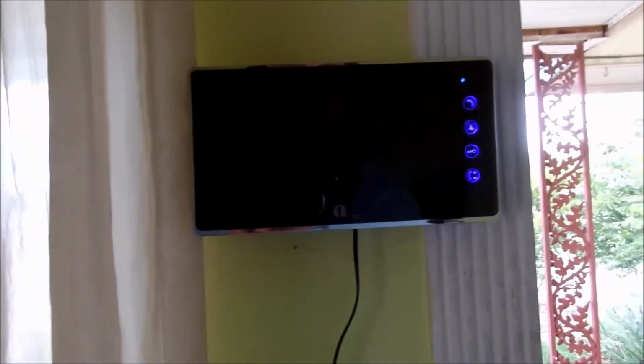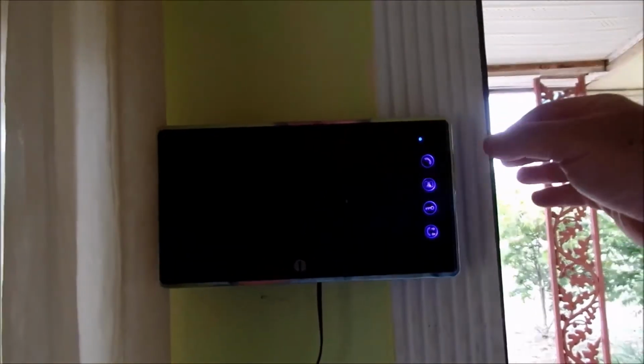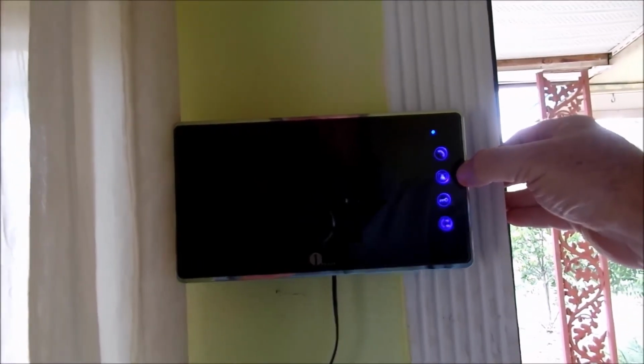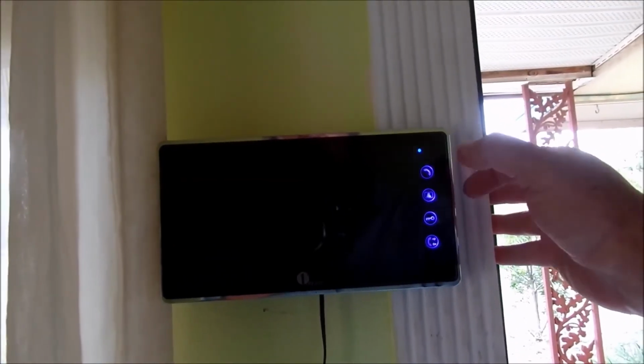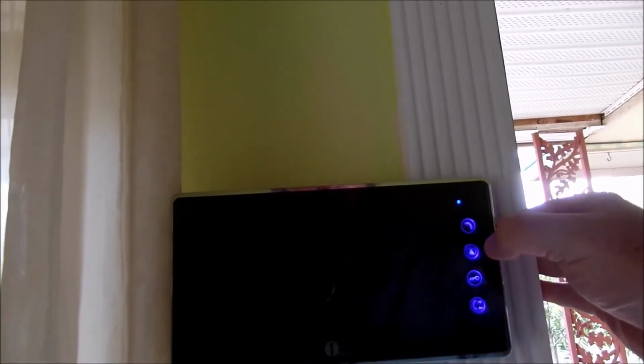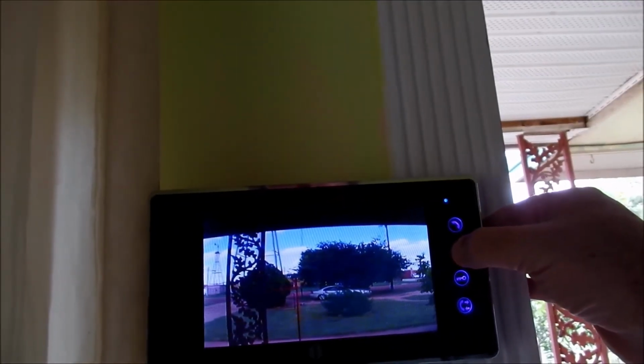And that was the one that my mother liked, so that's what we've set it up for. That changes the melody. So you're holding this button down for 4 seconds, then pressing this one, and then pressing that button until you find the melody that you like, and then finally pressing this button to lock it into place. Now let's say you want to change the volume of that. Hold this down. Okay. 1, 2, 3, 4.